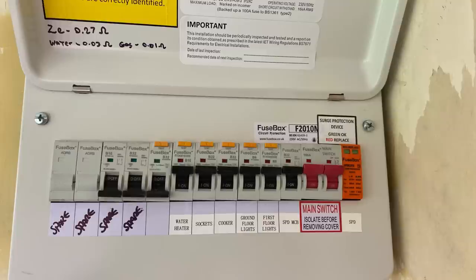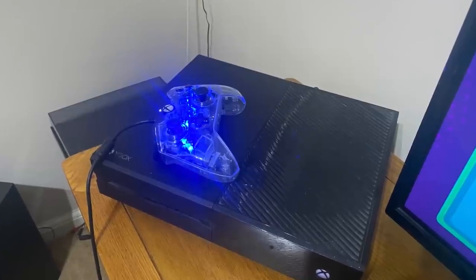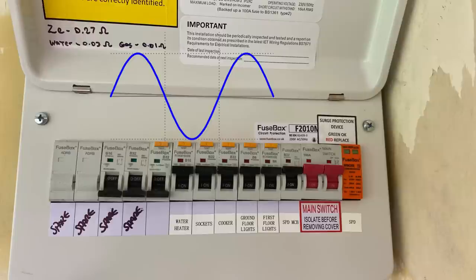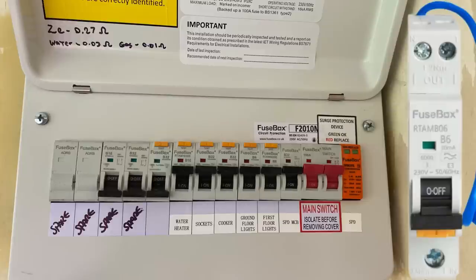Just a quick explanation of why Type A is the minimum. Type A RCDs can withstand up to six milliamps of DC. This is not the earth leakage current of 30 milliamps for the RCD element - this is for the AC circuit connected to something that becomes a DC item: an LED downlight, games console, computer. If there's a fault or part of that circuit breaks down, the DC element could appear on the AC side and affect the AC waveform. These Type A RCBOs can withstand up to six milliamps of that DC current being leaked back and still perform correctly. The other two types are F and B, which we'll cover in more detail in other videos.